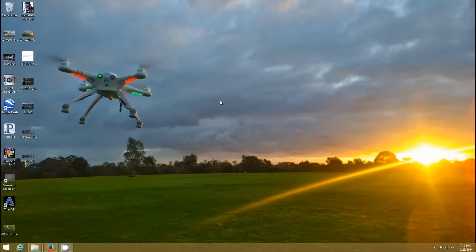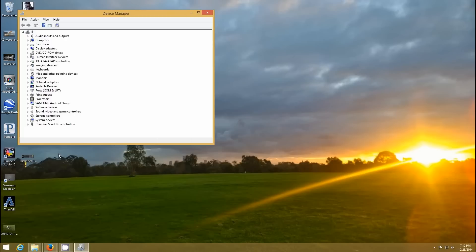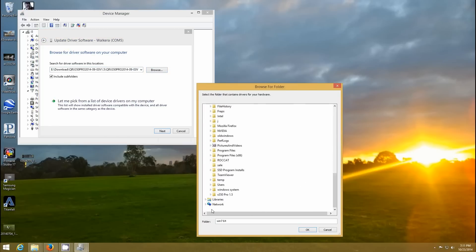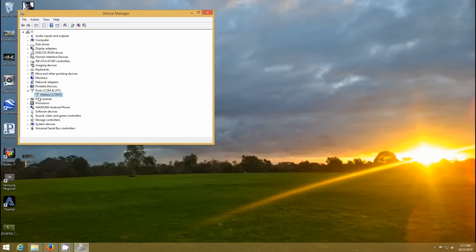You have it plugged into the quad — your lights will be flashing on it. It might pop up as an unrecognized device or something like that. You're just going to go to your device manager. I'm using Windows 8.1. You'll have one here with an exclamation mark, probably showing as unknown device. Select it, right click, and choose 'update driver software.' Click 'browse my computer for driver software' and navigate to wherever you put those files. Try Windows 7 64-bit — if it says it's not found, try another one, because I'm using 64-bit but it took the 32-bit version. After that installs you should have it listed, and pay attention to the COM port — mine is COM port 5.